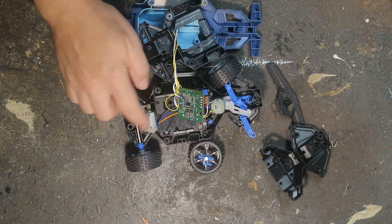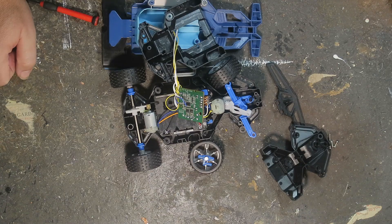There's no servo - just a simple motor on the steering and the same on the back, and they're quite small. We probably just need a small motor driver connected to our controller of choice. You wouldn't drive the motors directly from the controller because it would cook the controller, so you need an extra board to drive those separately. We'll investigate what our best option will be.